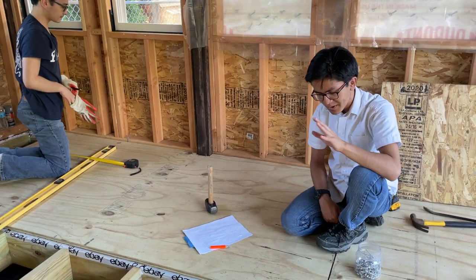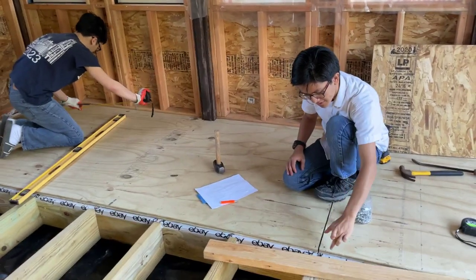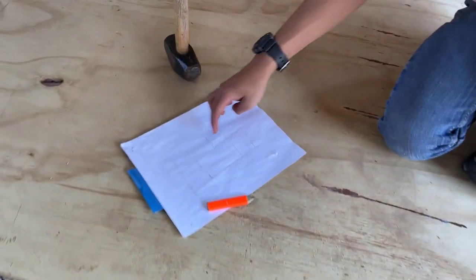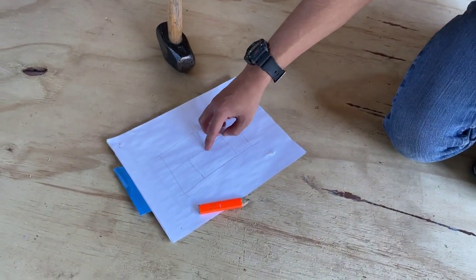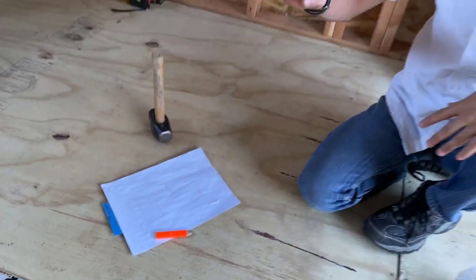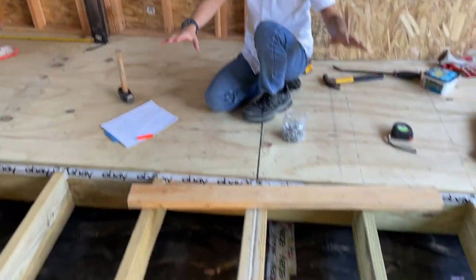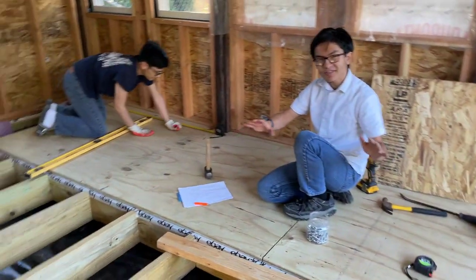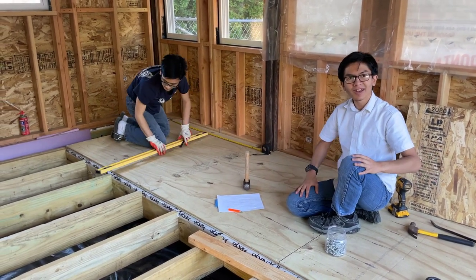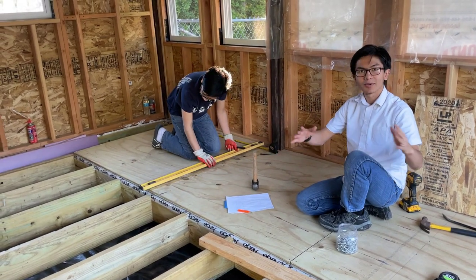Another interesting thing about plywood sheathing is that you're actually supposed to install it so it's not 4 corners. They recommend that you stagger them sort of like this. So it shouldn't have 4 corners touching. It should have maybe two touching at most. But in our case, these are actually two separate decks, so it's a bit different for us. And in the end, it doesn't really matter, because we're not building it like an actual deck. This is more like an enclosed room.